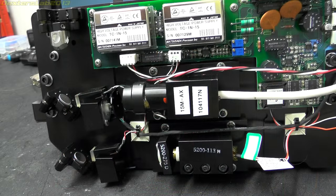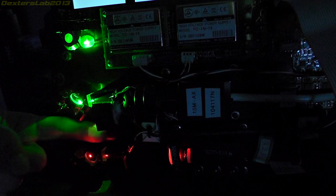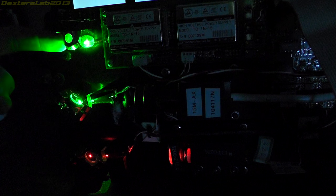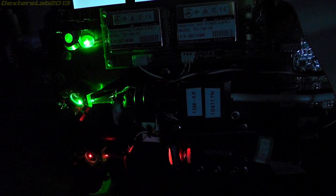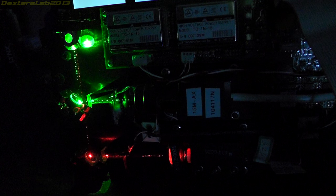Before I start taking all this to pieces, people want to see the lasers on, so let's just give that a quick try. We've got the red laser on the bottom there, which comes through here, bounces off this mirror, and we've got the green which goes through the wheel that does the attenuation, off this mirror here and up into this mirror which goes through the base plate. If I just puff a bit of dust in the beams you should be able to see them there. Looking from the other side we have the sliding arm here — you can see the green and red laser hitting the mirror and then going straight upwards.